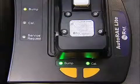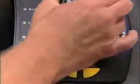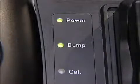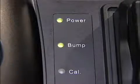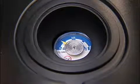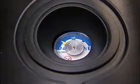When the 2 indicator LEDs above the buttons glow green, remove the QRAE 2 from the dock. A green LED indicates the bump test or calibration was successful. A red LED indicates the bump test or calibration failed. If a bump test or calibration fails, check the calibration gas pressure and try again. If it fails again, it is possible the sensor is depleted and must be replaced.